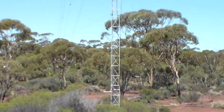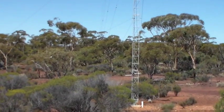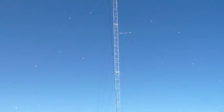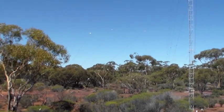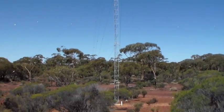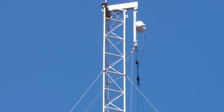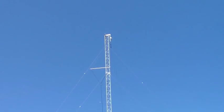This is a 20 metre mast — you can see most of it there going up to the top. As I say, if you were really keen and had a big backyard you could put one of these in. This is actually an NVIS antenna — a near vertical incident sky wave antenna — so this is for HF comms up to about 1000 kilometres. Because it's terminated in a resistor right at the top, it's completely flat from about 1.5 to 30 MHz right across. So you don't need any kind of matching arrangement — you just connect your radio to it and away you go.